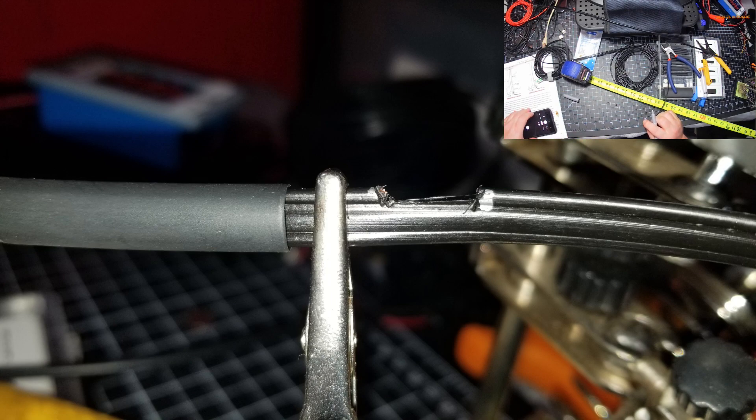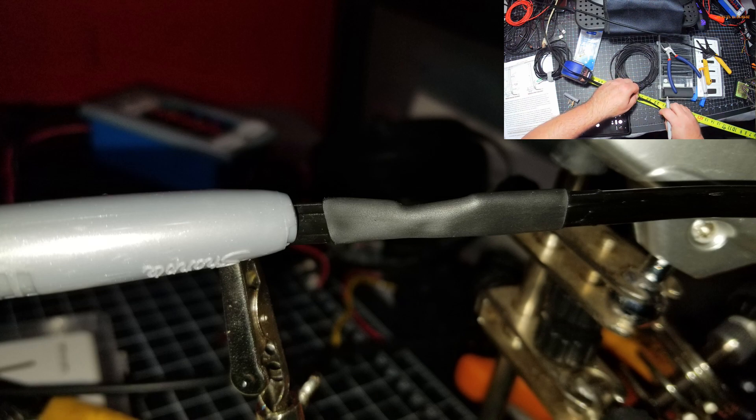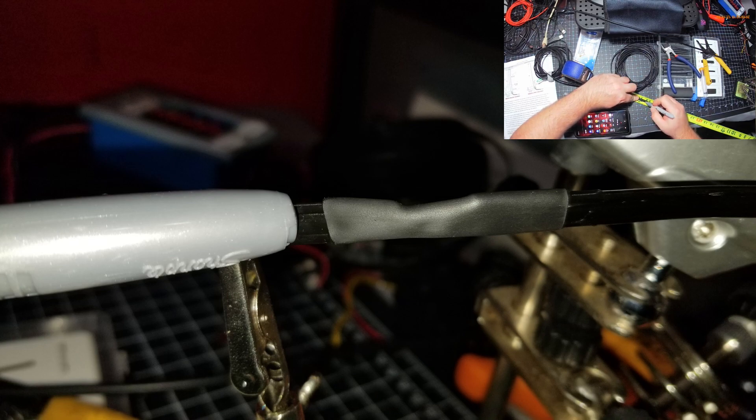Towards the bottom, we're going to cut similarly to the top. We're going to create a section at the bottom where we give ourselves some room to make adjustments to the antenna before we solder the RG-174 onto it permanently. You want to check the SWR, make some adjustments, and then finish off that bottom part. Here we've made that little cut, put on the heat shrink, melted it down, and this section is good to go.